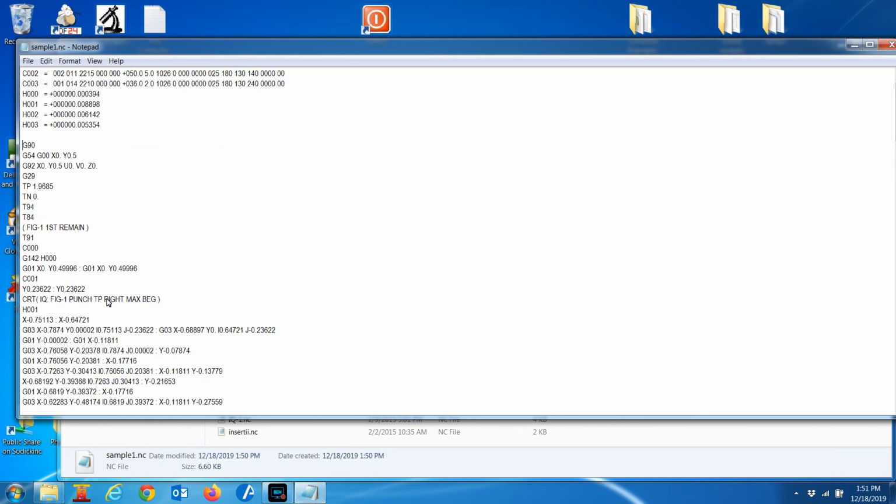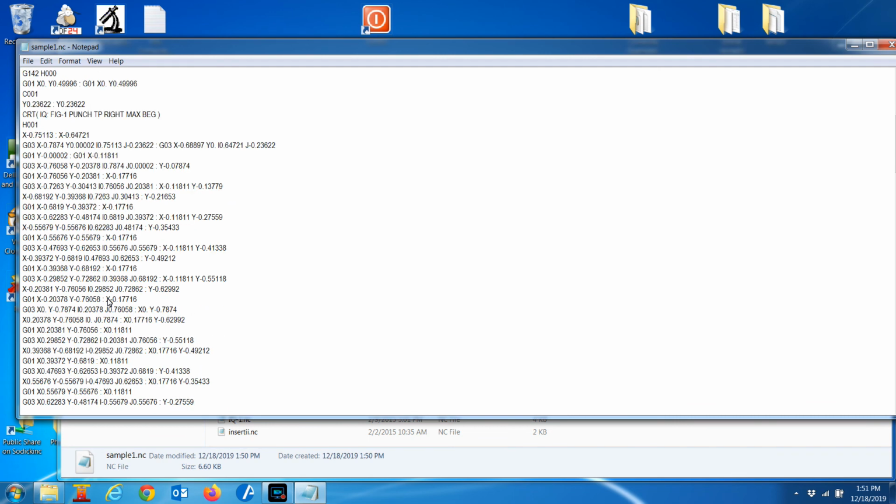One thing to note, we're a 4-axis program, but our control does 4-axis with circular interpolation. So some of the older controls don't have the advanced capability that a Sodick has, and it writes a G01 XYUV format program, even though you're doing circles, or arcs I should say, breaks the program up into all line segments, right? On a Sodick, it doesn't work like that. You got true geometry, G03, XYIJ, then there's a colon here, and another G03, XYIJ. So this is the bottom geometry on the left with the top geometry on the right, bottom, top. So it's 2-axis programs basically sandwiched together, isolated by that colon.